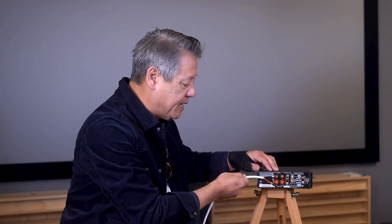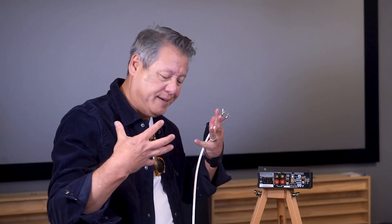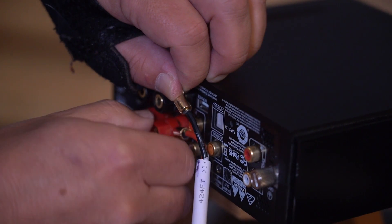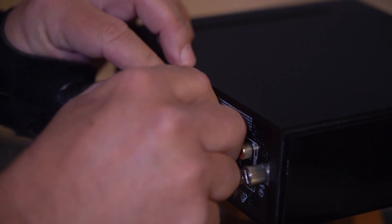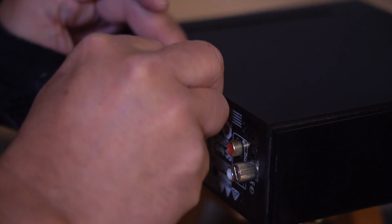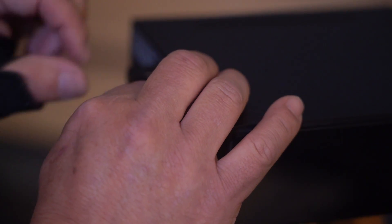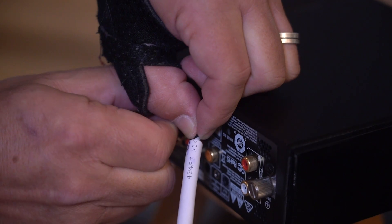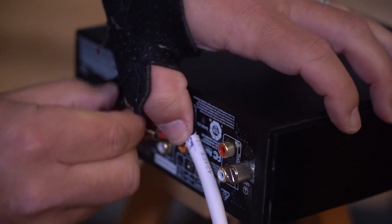It's not a bad idea to have the spade match up to the kind of connector you have. I'll show you how easy it is — these just slip right over the threaded barrel and you tighten it down. This is where amateurs don't understand: once it starts to feel tight, it's only starting to. I've just made about four turns after it began to get tight. You really want to bear down with your fingers and get it really snug, otherwise the first time you move the speaker or amplifier it'll tend to fall out — and you can again wind up with a dead short.